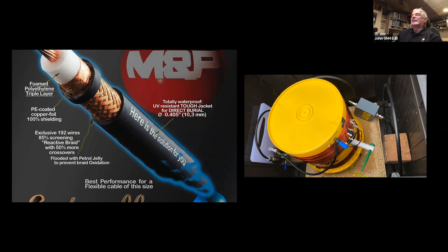And that's the antenna, and there's a multiband vertical. Or if I click the variometer in, that's it. And it's a 630 meter vertical. So a future plan may see electric relays put in to facilitate the changeover. But at the minute, I have to put the coat on a wet winter's night and go down the garden and turn two switches if I want to go on to 630 meters.